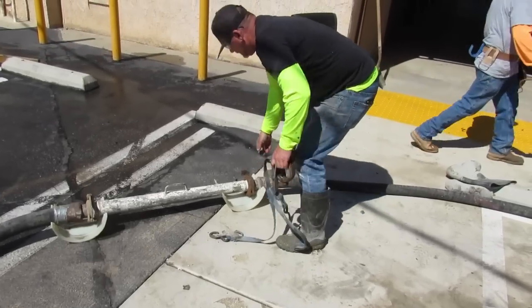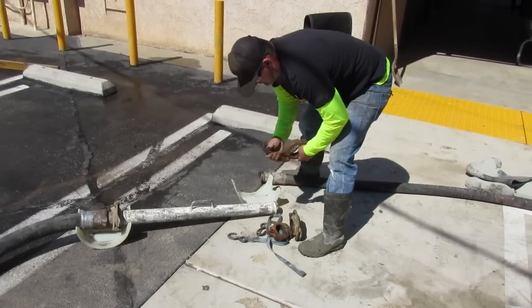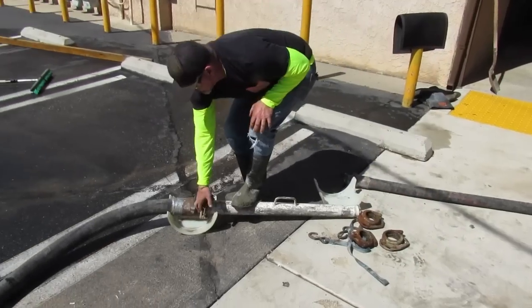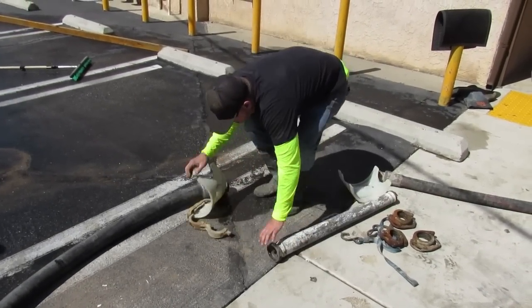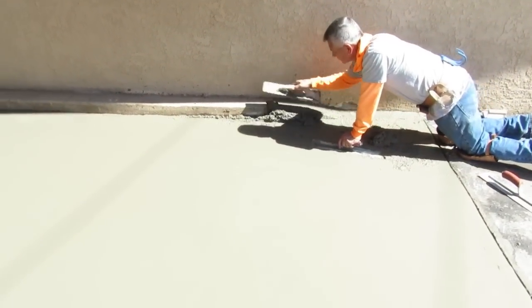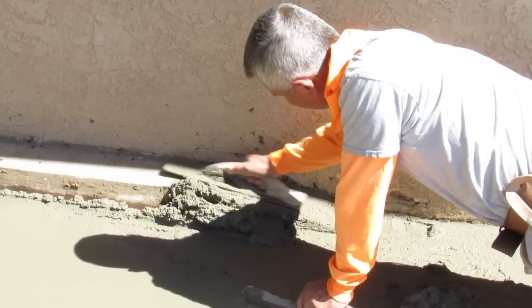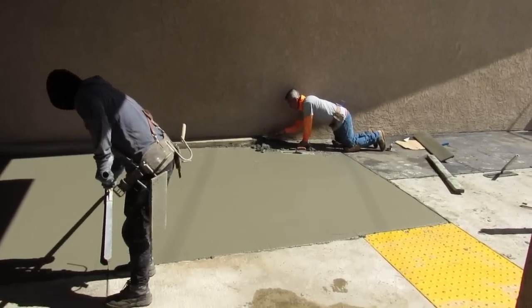And it's a totally different style. It has to actually look good. You can't broom it wet, and you come out here and you put stamps down and you're stamping on them with your feet, they will throw you the hell out of here. You got to wait till that stuff's going off, and you got to beat it in. You got to put a perfect etch in it.